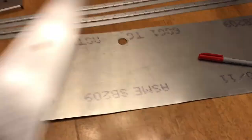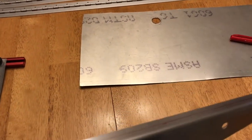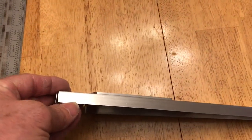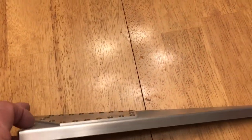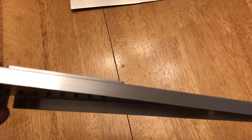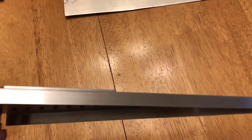What we need to do is put the ribs into the skin and align them with the holes. We have to align them so that the holes fall approximately halfway up the flange — a quarter inch up the flange. So you put a mark with a fine point Sharpie along the flange and you can fit the rib and actually see the line through the holes, and then drill into the rib flange.